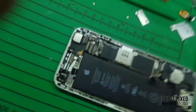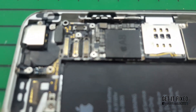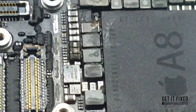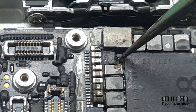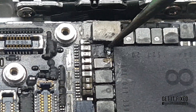Basically this one is a very easy repair. All you have to do — as you'll see at the end of my video — there was a capacitor shorted. Remove that capacitor and replace the diode, because that one is already burned. You have to put a new one in.